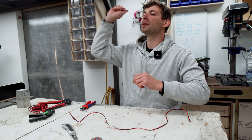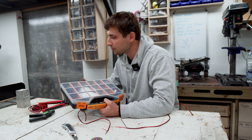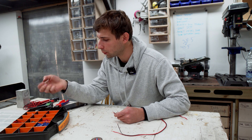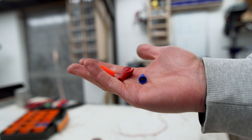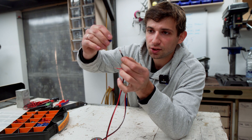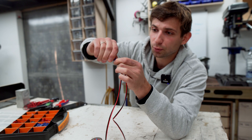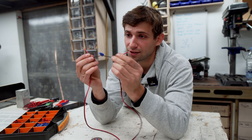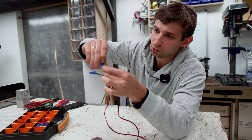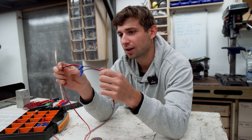This method works — we've all been doing it for many many years and it's been working fine. But there are quicker and better options. I have a little box with all my favorite connectors. First, let's look at wire nuts — little guys like this, all different sizes depending on the size of the wire. A wire nut is quite fun: you just take two ends of the cable, you don't even have to twist them, put the wire nut on top and twist it three or four times. You'll feel when it's fully twisted and you have a quick and quite secure connection.